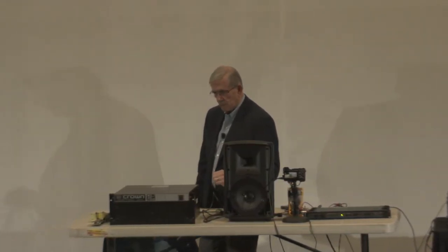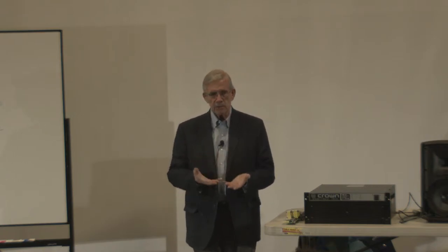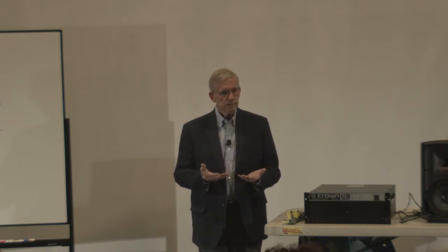The real revolution happened when Class D came along. It just happened that the next class down that they could pick was Class D, but it's also very nice because D stands for digital. So this is the first time, when these amplifiers came, that they deviated from amplifying the analog signal.